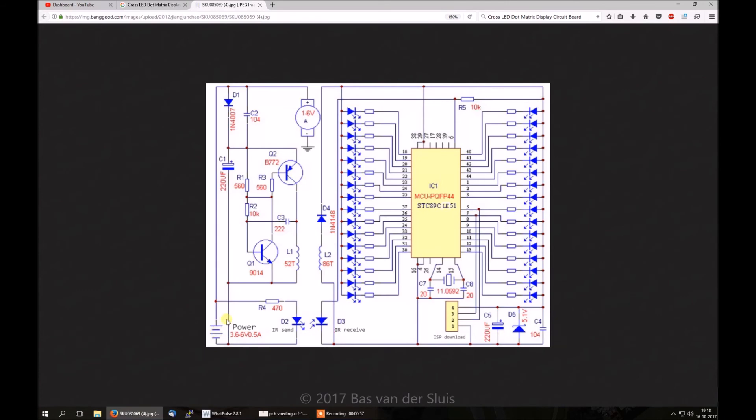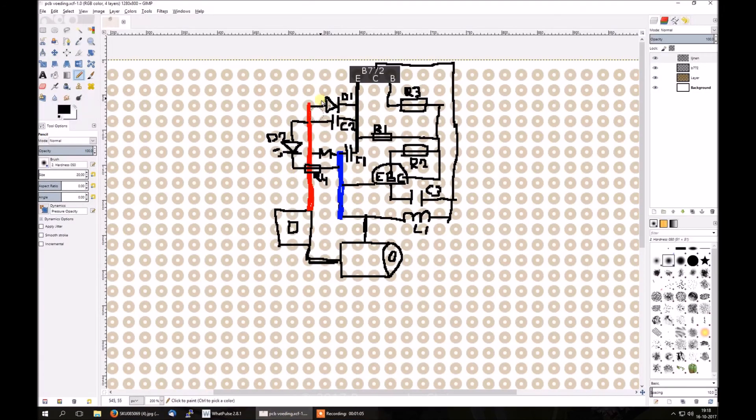The pins are a little bit too large, it won't fit on the circuit board, so I will see how to fix that, but I think I can manage. So let me switch back to my drawing. I drew a red and a blue line over here — this will be the main power rail. The motor is just connected directly to the USB, and the rest of the circuit board is all about switching and creating some sort of alternating current for the coil. This is the power switch and this is the connector. Here will be the connector for the infrared LED, and here will be a connector for the coil.